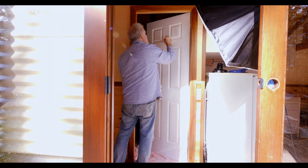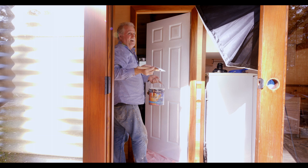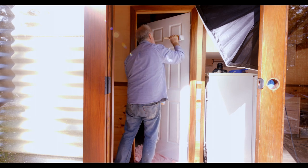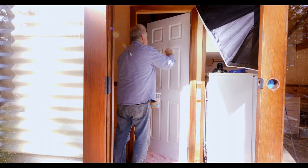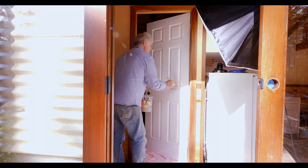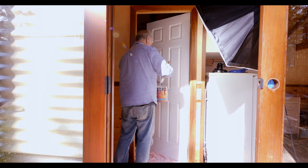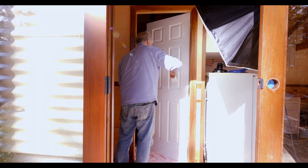You'll find that if you happen to really poke and start trying to get the paint in there, most likely you haven't got enough paint on your brush. It's one of the biggest mistakes a DIYer makes — never having enough paint on their brush. The DIYer dips in, scrapes all the paint off, and then goes to work. That's still going to work, but you're going to have five times as many dips. So if I can implore you to get out of that habit of scraping your paint off, you're going to go a lot faster.